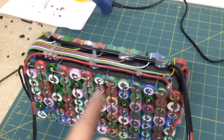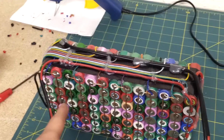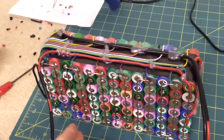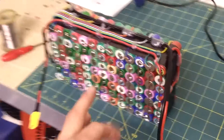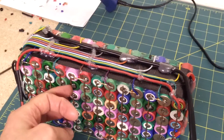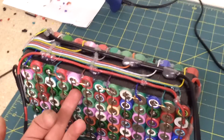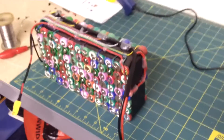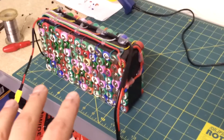The first pack was more out of balance in general — some cells more varied than others — and one pack has got a potentially dodgy cell in it, and that one is the lowest bank as well. It might need some attention. Worst case, I'll be able to gently unsolder the end of it and push through a replacement cell — I've got some spares. The whole pack is certainly not scrap and I was prepared for this kind of situation. It certainly still works fine.